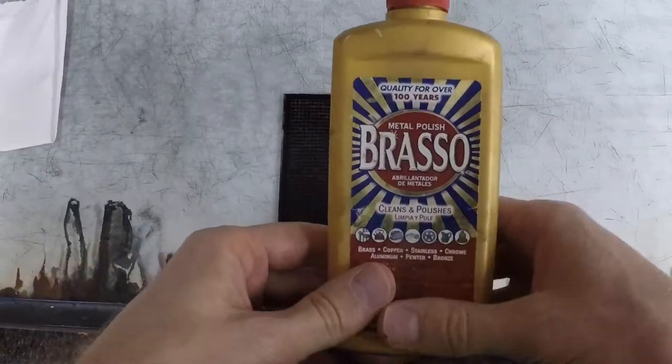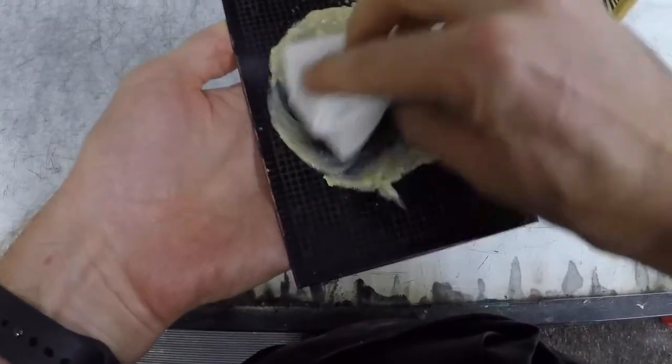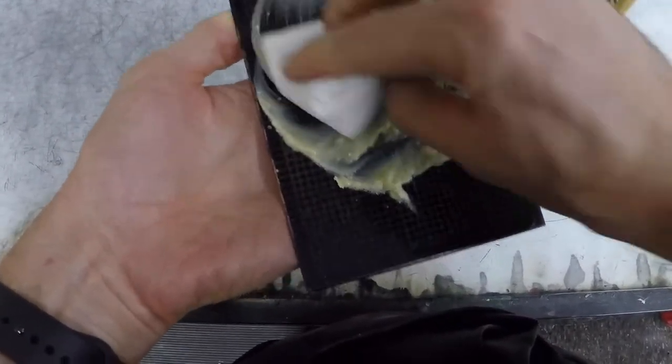The guy who makes BIG, Andrew Baldwin, suggests a few ways to remove the ground after etching. His first suggestion is citrus paint stripper, which I don't have. His second suggestion, Brasso, doesn't work well. I do have Goo Gone. It seems to work fine.